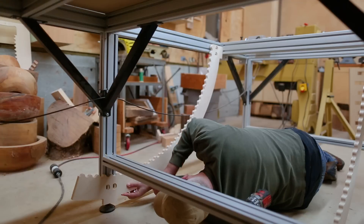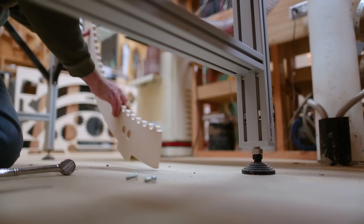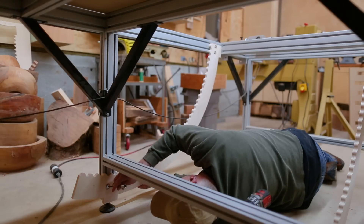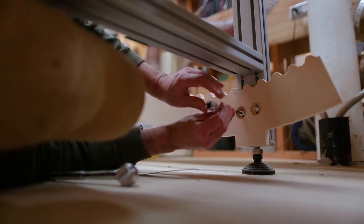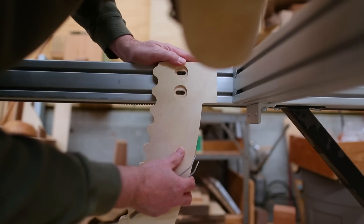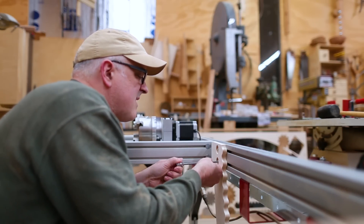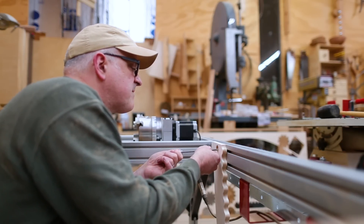I installed the arcs that go along the sides of the adjustable table — those install into the frame the same way the spoil board does, with the same little bolt detail in the wood. It took some finessing but wasn't too bad. I tried to come up with a shape so that when aligned right with the frame it would put the center at the hinge point, so the arc of the table would follow these rails. The idea is that I can clamp the table at each side to these rails, so whatever raises and lowers the table isn't the thing that holds it in place.